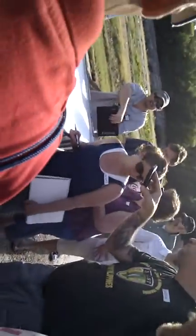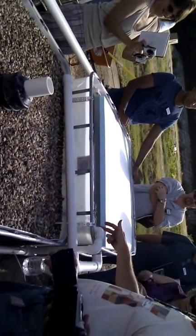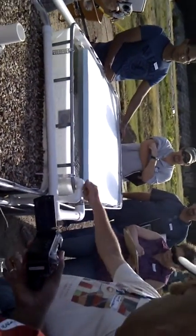Anybody want to guess what that is? It's a siphon break. This pipe is full of water right now. Now if that pump shuts off, it'll just siphon back down and drain this down to that level and overflow the sump. So what this does is it lets air in when the pump shuts off, instead of sucking the water out of here and draining it back down to there, auto-siphoning. It'll break the siphon.